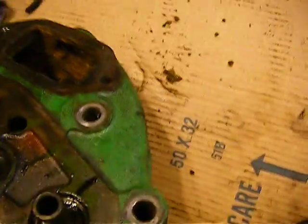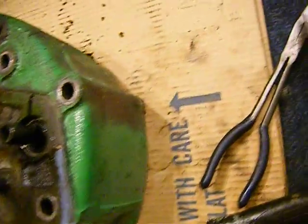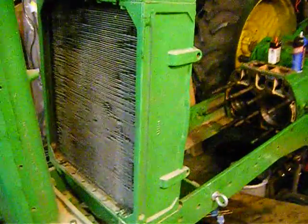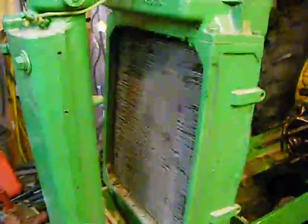What I think they did on this tractor is they tried to run it on kerosene fuel oil or something like that, and it wasn't hot enough. The tractor didn't have shutters on the front of the radiator, therefore you couldn't shut the airflow off to the radiator to get it hot enough to run kerosene. They may have done that and that's what might have coked it up really bad instead of just running gasoline.